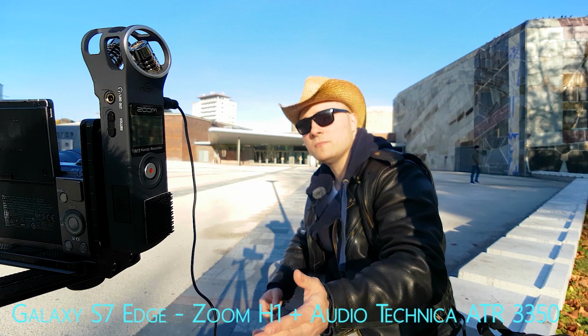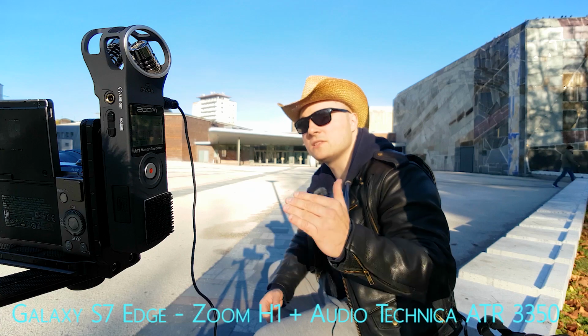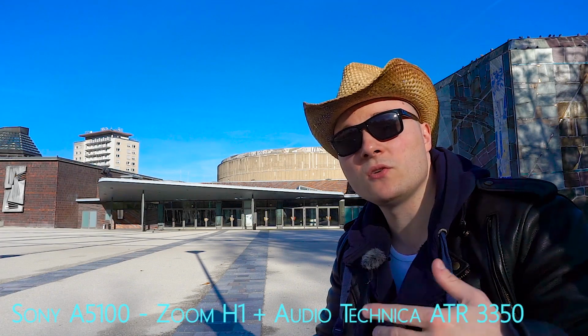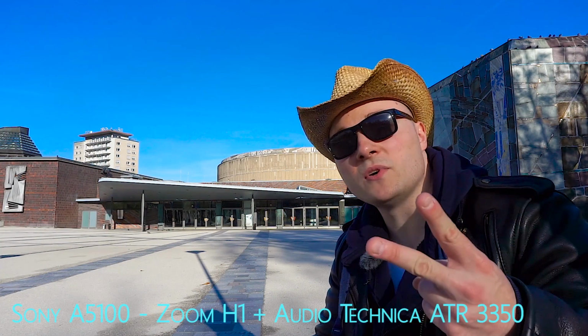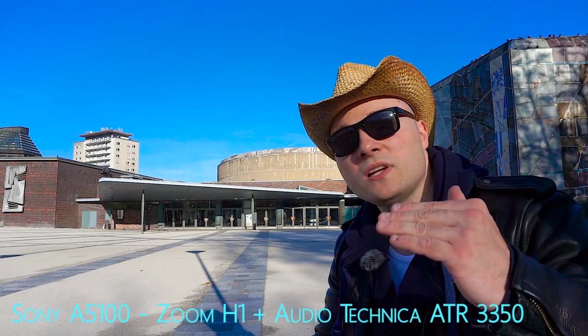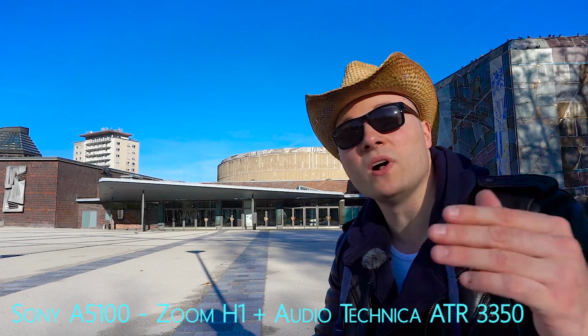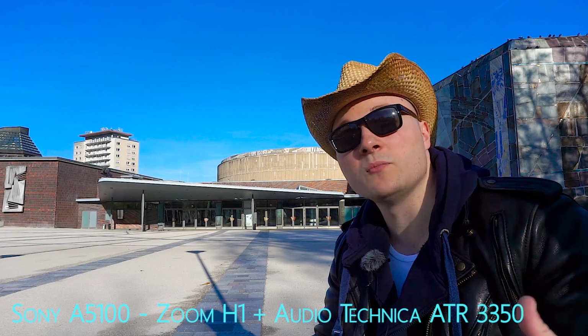Just place it on your collar, then start talking in your normal voice at an easily sustainable volume and use the input level selector on the right side of the Zoom to make the signal level to minus 12 decibels. Why minus 12 decibels? Reason number 1 being you're getting a signal with decent volume. Reason number 2, you still have enough headroom to 0 decibels, which is where audio peaks, so you're not running the risk of ending up with distorted audio while you record, which is something you cannot recover in post-production.